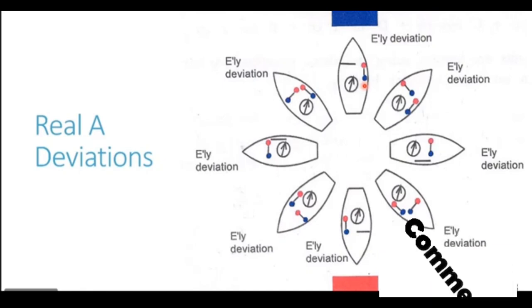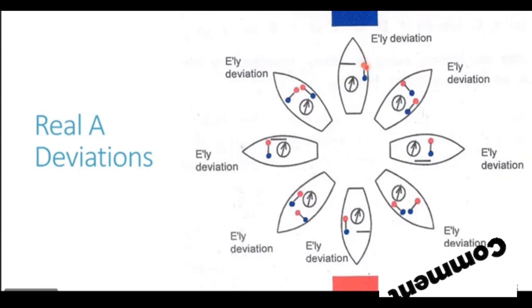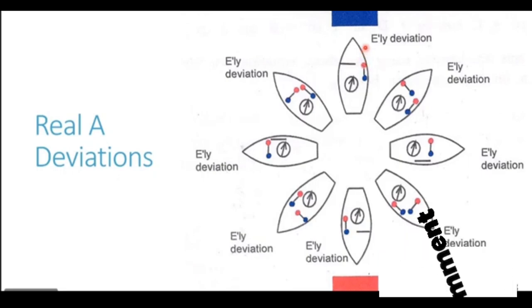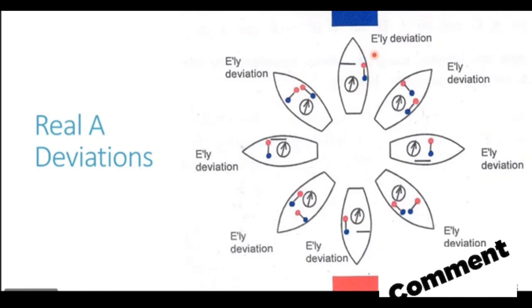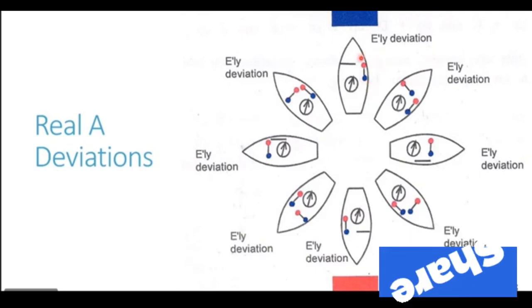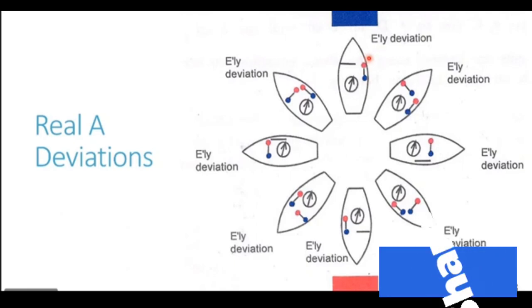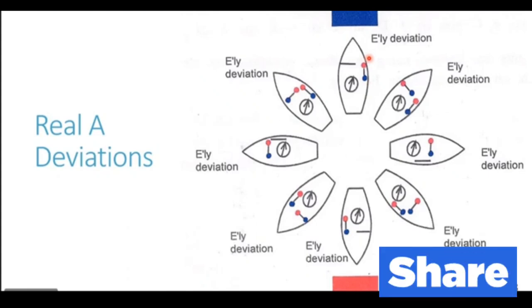And these lines of force, going from south to north, will be coming out from the forward end of the longitudinal. Since they are coming out of the forward end, you will see that the forward end acquires red polarity. So this is the reason why you see in the diagram the aft end of the longitudinal has blue polarity and the forward end has red polarity. So we now understand the different poles generated on the fore and aft longitudinal.